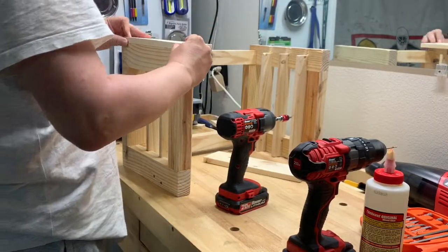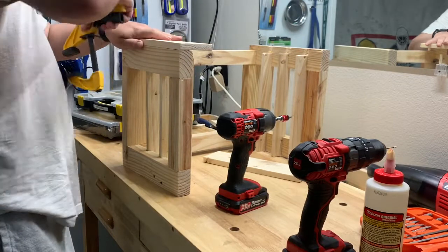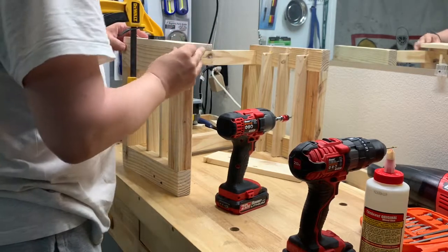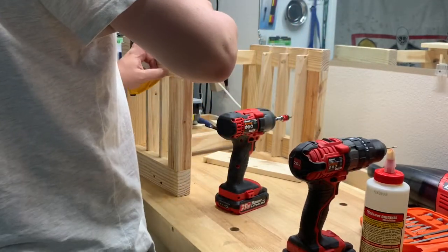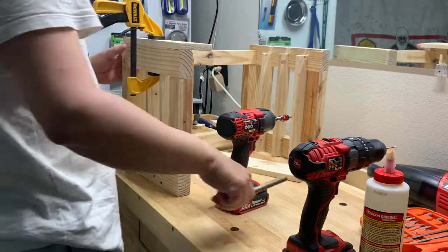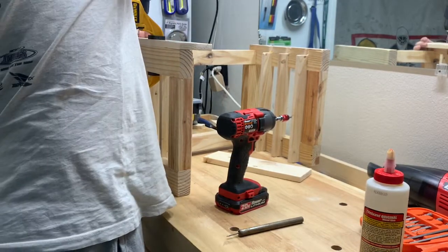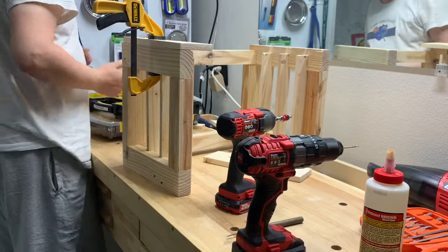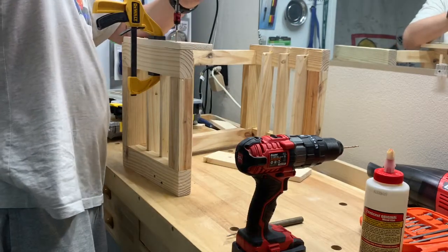After gluing the box structure back together, you can see I've put my slats in to serve as little shelves. They're a little bit shorter than I wanted — again I was using scrap pallet wood. I put the gap in the back and made them flush with the front. I also added a couple of pallet slats in the back as a stop so when you slide the bins in they don't go all the way through. I cut some planed pallet wood to the height of the bin and screwed them in on both sides to make sure the storage bins don't slide all the way out to the back.